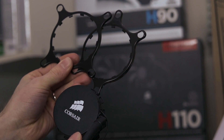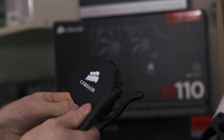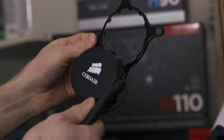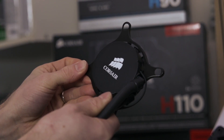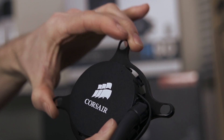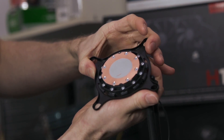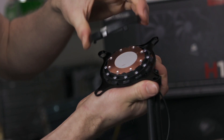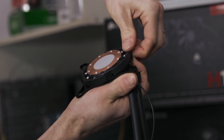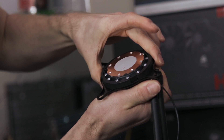The Intel bracket has a square bolt pattern, while the AMD bracket has a rectangular bolt pattern. We'll be using the Intel bracket. All you have to do is take the notches on the CPU block itself, put them through the gaps on the hold down plate, turn it slightly until it locks into place and it no longer is able to rotate on its own. To keep the hold down plate from accidentally wiggling loose, Corsair includes a plastic retention clip that goes on the bottom. There are four snaps that go into place, keeping the hold down plate securely where it belongs.